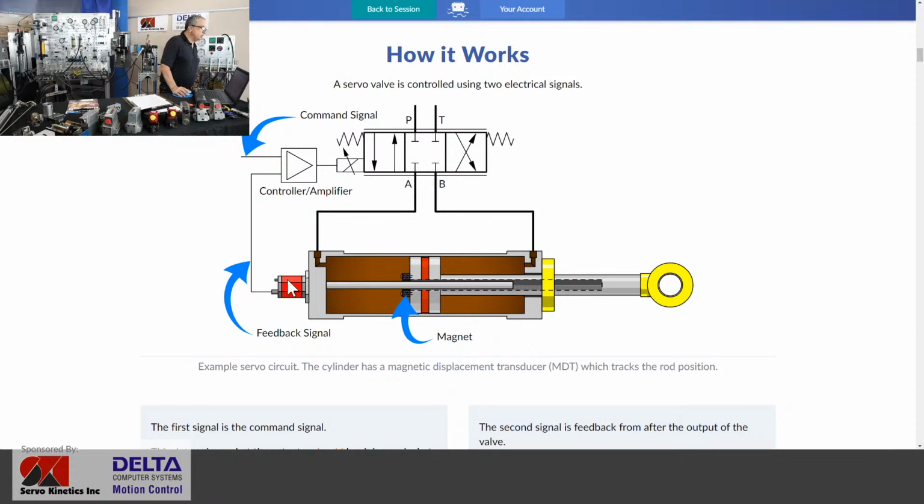So that magnetic displacement transducer that's threaded into the back of the cylinder has a long rod or waveguide, and that actually fits into an opening in the back of the cylinder rod that's been gun drilled to a larger diameter so that that waveguide fits in there very easily, that rod. And then riding on the back of the piston, and we'll have a look at these pieces shortly here on the table, is a magnet. A donut-shaped magnet, a toroid magnet, has been screwed to the back of the piston, and that magnet is helping that transducer sense exactly what its position is at any point in time. So that's the feedback loop that is absolutely critical to what's happening here. And that should really be a critical part of that definition if we're out looking for what is a servo, or if we're looking up what is a servo mechanism. That feedback and measurement of that is a very important aspect.